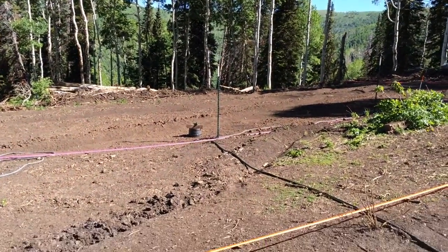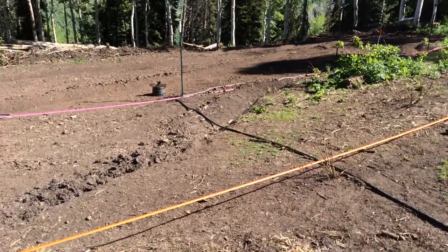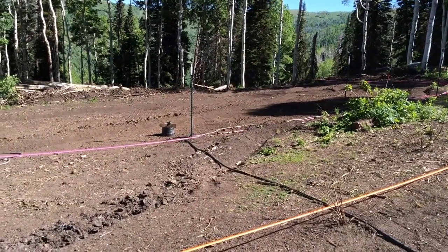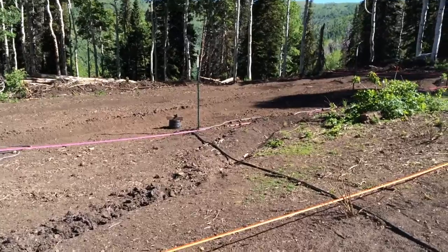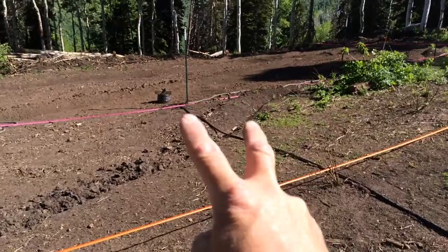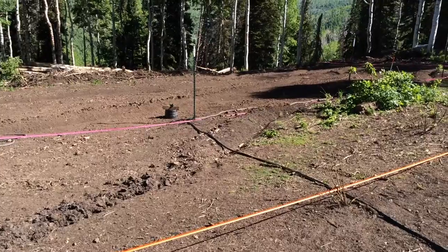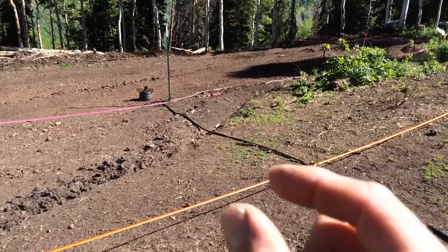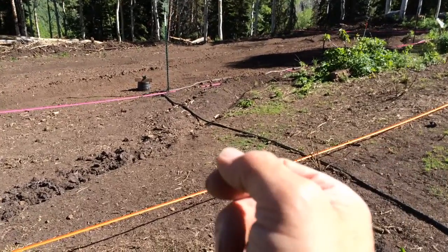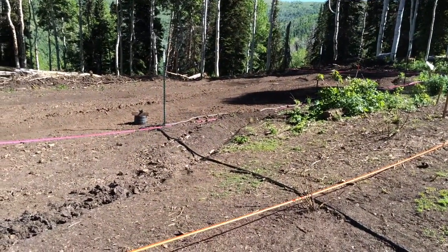So we have a 5/8. This is actually a 3/4 inch hose, but the rest is a 5/8 inch hose. I will show later how I really built this. But we use Y splitters, and when you get splitters, it is important to make sure that you get some that have a big hole through the whole thing, and not some of these, because of the ball when you close them. There's like a thin opening, but these do not have that, so that's awesome.